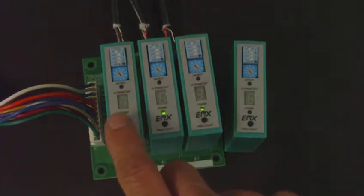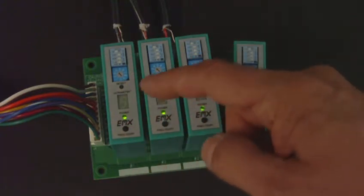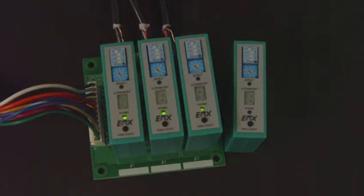I want to demonstrate the use of the ultrameter on the Ultra DTEC. The ultrameter displays the appropriate sensitivity setting to detect a vehicle that is positioned on the loop. When a vehicle pulls up to the loop, a value shows up on the display. As long as I adjust the sensitivity setting, it will detect that vehicle. If I get a value that's lower than the setting, it does not detect.